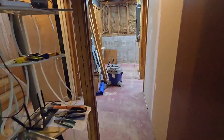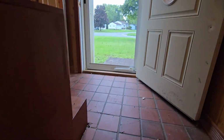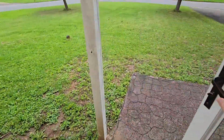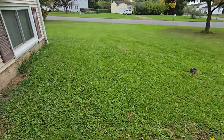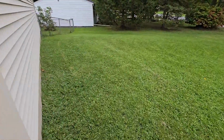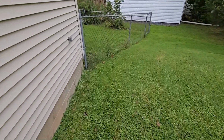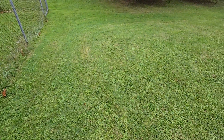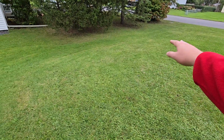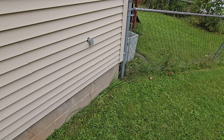And so my original plan was just to pipe it directly outside the house there and just let it drain onto the lawn. So there's a pretty good slope. My plumber advised against that. He said it's just going to cause a mess, and his recommendation was, at a minimum, to dig a trench and lay a pipe and have it come off the slope, draining down the slope so it's not all puddling right next to the house, which I agree is definitely a better plan.